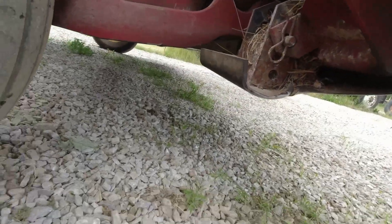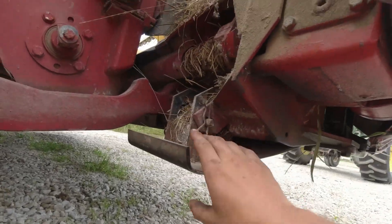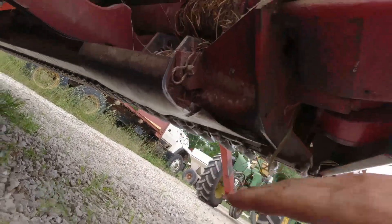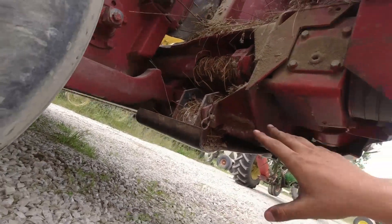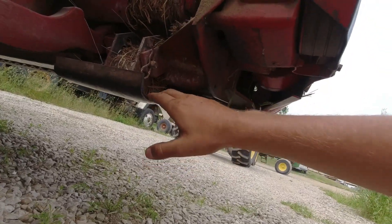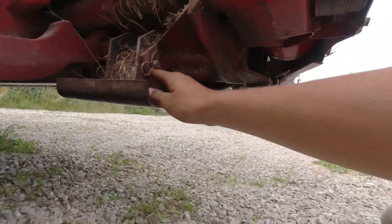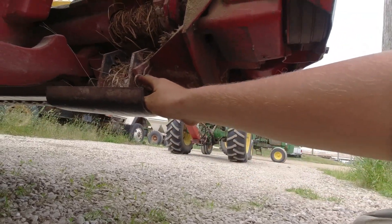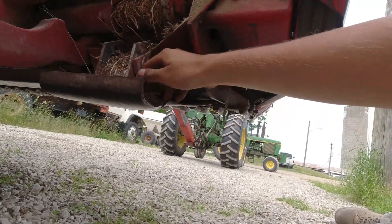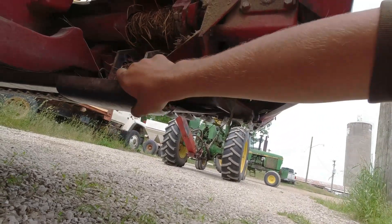What we got to do to prepare for that is, since I know it's not going to be smooth like a hay field, this hay bine has these shoes - that's what we call them - and it's just a depth guide. So all I'm doing is the equivalent of adjusting your height on a lawnmower. We're gonna move this; it's in the third hole now, we'll probably move it up one hole for now and see what that does when we're out there.